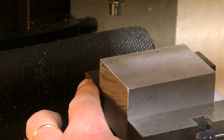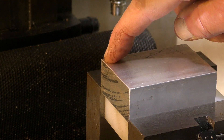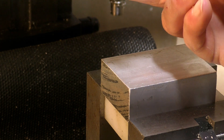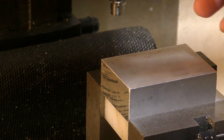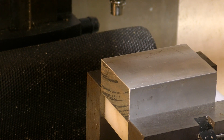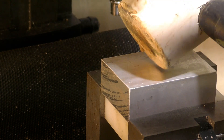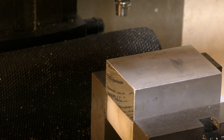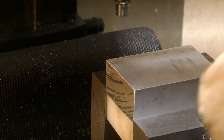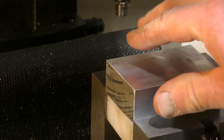Okay, so we're flush there on the edge of the jaw of the vise, in the same plane as the corner. I'm going to bring this very sharp tool down and bring it very close to this corner and set our XYZ. Before we do that I'm going to tighten this up and then settle it down with a hammer. That just settles it down a little bit more. Now you can't move the Teflon underneath it, so I know it's down on top of the Teflon nice and square.